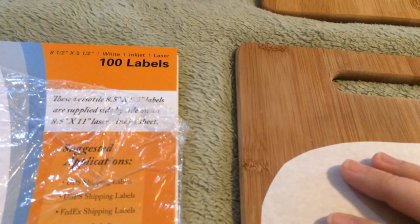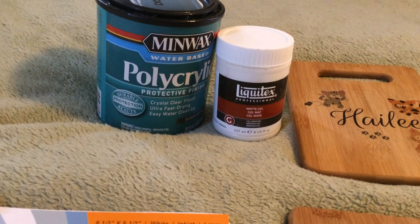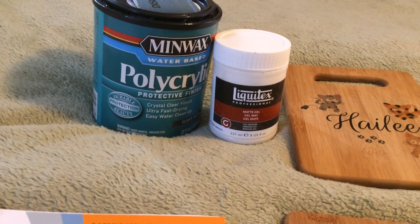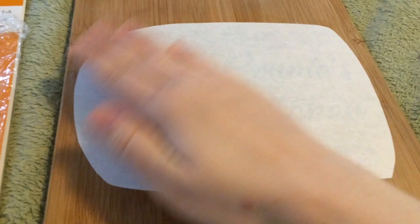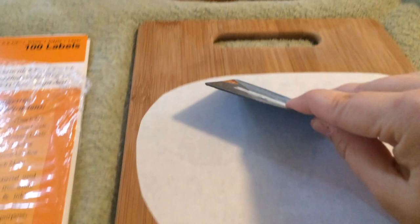I've tried this with polyacrylic and it doesn't work — the image will actually bubble and it won't stick. I don't know why, because I've been able to use polyacrylic with the paper rubbing method just fine. Liquitex is wonderful. So you take the Liquitex matte gel, put it on your wood area wherever you need it. I'll make like a square around my image, put my image down, take a piece of paper to wipe off all the excess, and then take an old credit card and scrape around the sides.